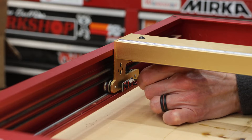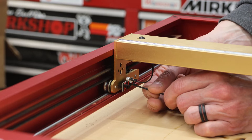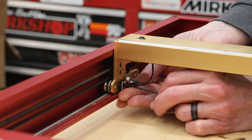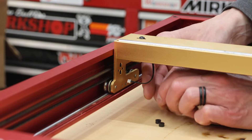The process of removing these sensors is pretty straightforward. You just need to disconnect the electrical connector, and then using an Allen wrench, you remove the two screws that hold the control board to the frame of the machine. These are spaced out away from the machine using a couple of plastic spacers. We're going to set these aside for now.